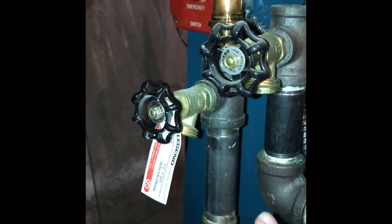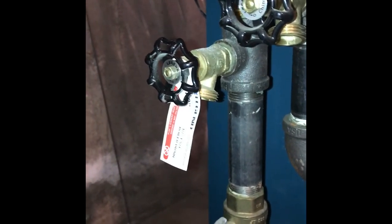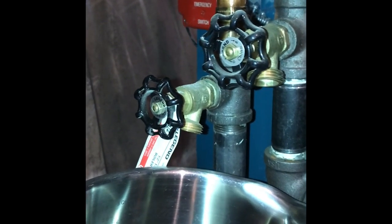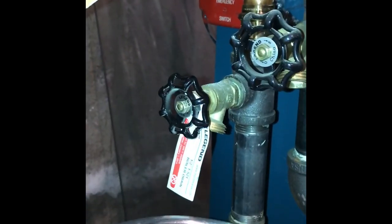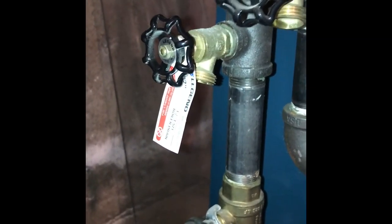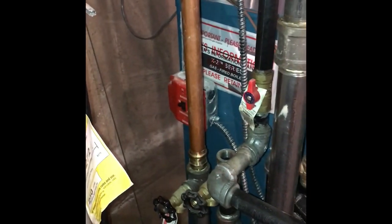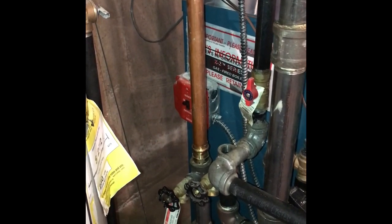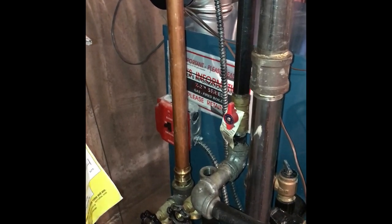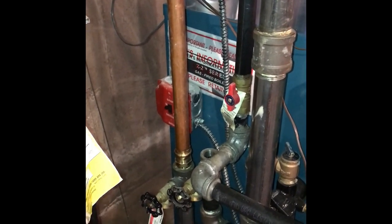So it is hot. What he did was take a pot from the kitchen, here is one, and put it underneath, let some of the water out, maybe about half a pot full or so, and then shut it back up, and then we could hear water, because there's an automatic fill. If there's not enough water and not enough water pressure, then there's an automatic fill of water into the loop. And sure enough, that fixed our problem.